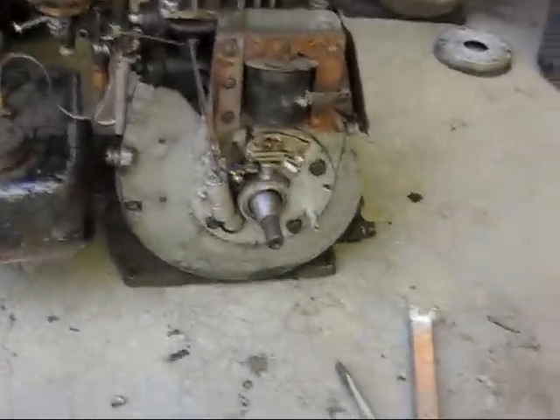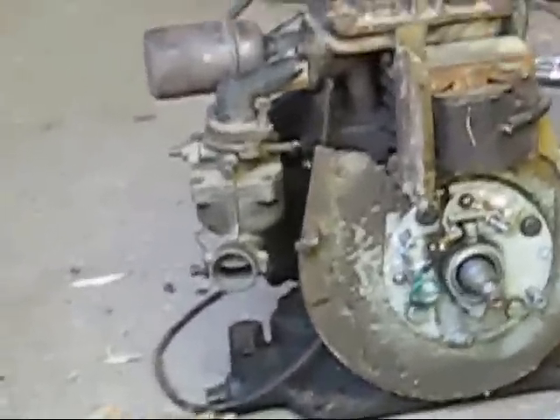Here's the WI with its flywheel off — you can see the magneto is exposed. I removed the cover. Here's the flywheel. There's the Model N. Basically the same engine block, same exact magneto, just different carburetor, different gas tank. It's got a gravity-fed fuel system on that, where this has a little suction system. This actually has a different carburetor than the running WI — this is a newer one. There are more fins on the head than my other running WI from 1941. I'll give you an update in a few minutes.